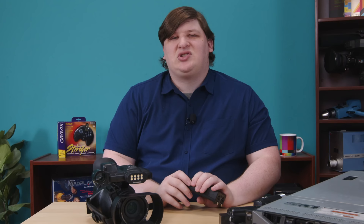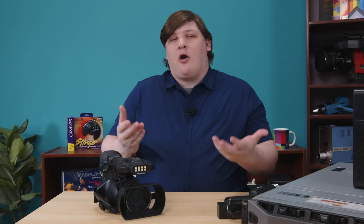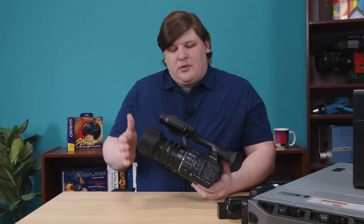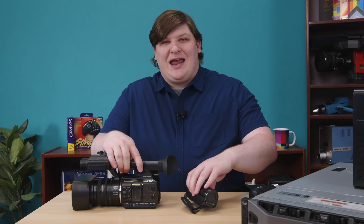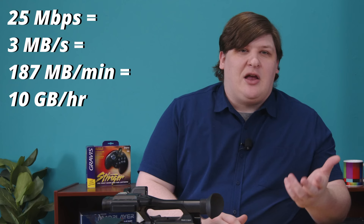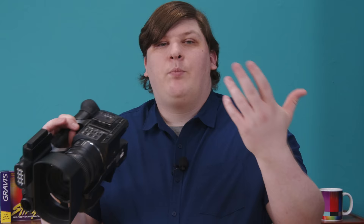So I ended up with gobs of useless footage just because my camera sucked. But as bad as that was, it didn't really harm me much because the files this camera outputs are not very big. The maximum quality mode is only 25 megabits — the same as the $200 Canon and only marginally better than the Sony. It's also identical to a DV camcorder from 1997 in terms of bitrate. At 25 megabits, you can record an awful lot of footage: only about 3 megabytes per second, or 187 megabytes per minute, or about 10 gigabytes per hour, meaning a 128-gig SD card could get nearly 13 hours of recording. Since the Panasonic has two SD card slots, I could put a 128 in both and roll for a whole day.